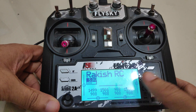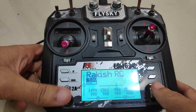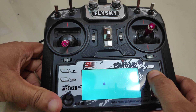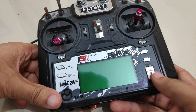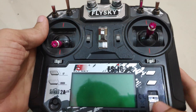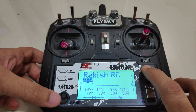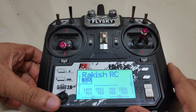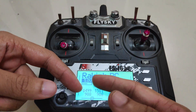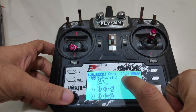I'll soft shut down the radio transmitter by holding the cancel button, then slide the power switch to the OFF position, disconnect the USB cable, and then power ON. That way you won't get the low EEPROM data error and the free storage will be reflected correctly.